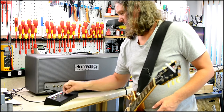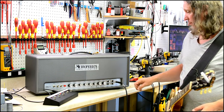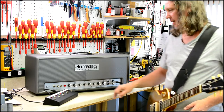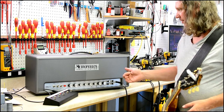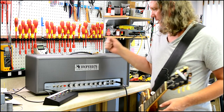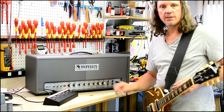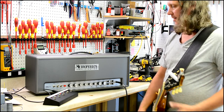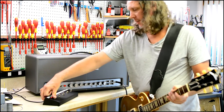Each channel does have its own master volume, so you've got independent masters and gains for each channel. The boost is on top of that — there's about six to eight dBs of boost available just on the fat circuit, and then if you hit the mid boost it's even more, at least ten to twelve. Of course it has the variac, has a half power switch, has the effects loop. This was custom tailored for everything that William needed for his rig — he had two or three different kinds of amps before, and now all he has is two DVL-1s on at all times and one spare, taken around the world.